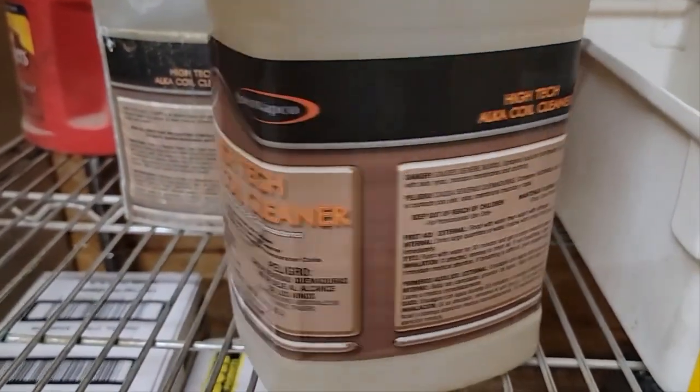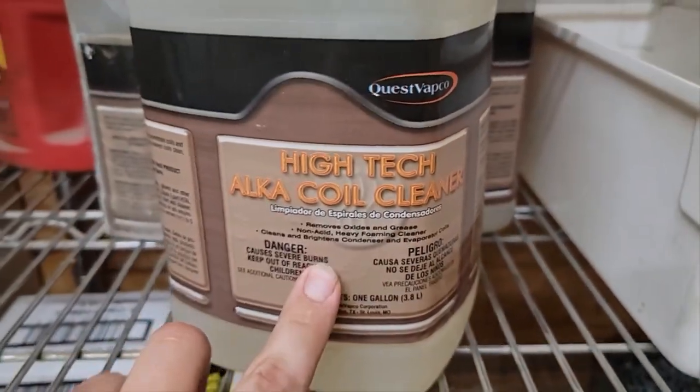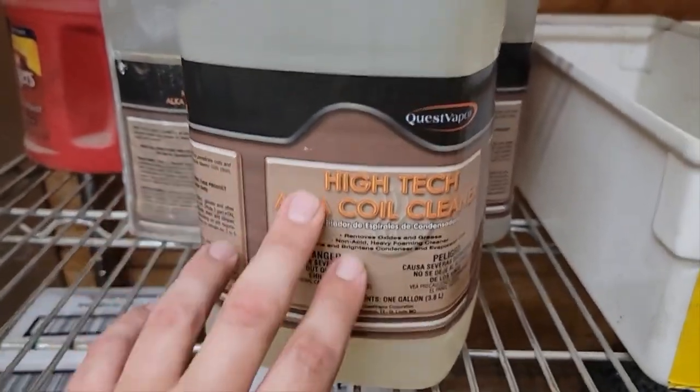This is the type of coil cleaner we use for cleaning outdoor condenser coils. If you do have to use coil cleaner on a micro channel coil, make sure you use a neutral pH coil cleaner — not something very acidic because you will end up causing more corrosion and more damage. You must wash it all off thoroughly; you do not want to increase the rate of corrosion on that coil.